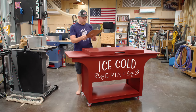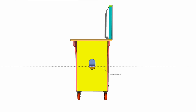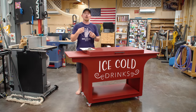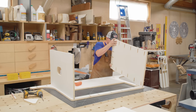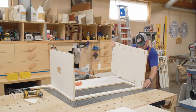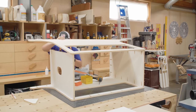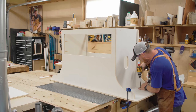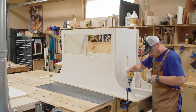Make sure the side panel with the drain is in the correct orientation. It's not perfectly centered vertically — it favors the top side — so make sure it is in the correct orientation when you drill the pocket hole screws to attach it and when you assemble it, so that the opening favors the top. For the assembly, start with the main case or box. Everything in woodworking is basically just a box, and technically we're putting a box inside this box with the cooler. After the box is completed, secure the case to the top panel. It may be helpful to use clamps to hold everything together before driving all the pocket hole screws.